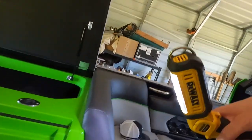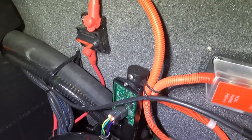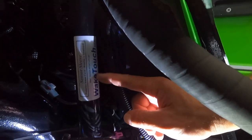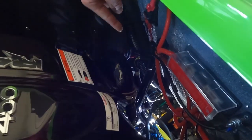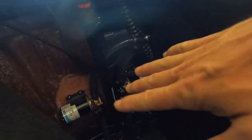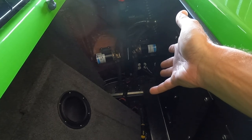I have one more sensor in these, and that's that guy right there, and it's fastened to the front of this engine compartment, and it's basically hooked to this through-hole fitting right here. It just goes out through the bottom of the boat, so it comes to this 90 and then goes up this tube, and this basically is a sensor to tell how deep the rear of the boat is in the water. But the thought is we're probably going to need to raise that one up a little bit, which won't be that big of a deal. And we may need to extend those vents somewhere in the middle so that sensor is higher. Otherwise, it won't do us any good to have a bag that comes up to just below these covers if the system shuts the pumps off before it reaches that.